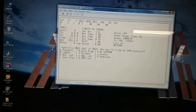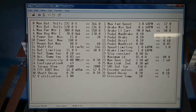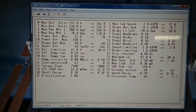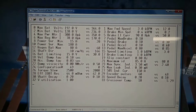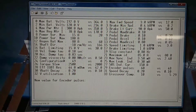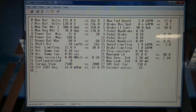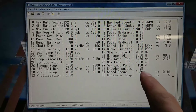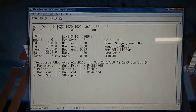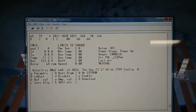So what we're going to do is flip that back off and go into the parameters here. We're just going to temporarily, just for testing purposes, type in parameter 29. Enter new value for encoder pulses - my test motor has 48, so we'll do that. You can see now it's set to 48. I believe we've changed it in RAM only, so we should be able to exit this and verify the encoder still works by moving it. It looks like it still works.